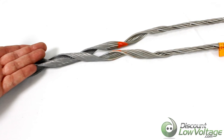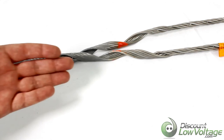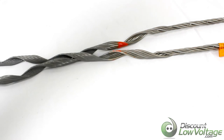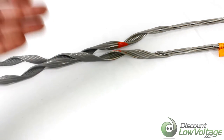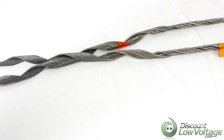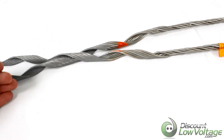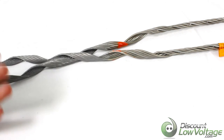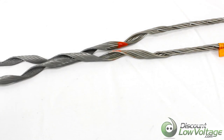The most common question I get asked about the light tension dead ends is what the span length is. If you're going from pole to pole, the 300 feet is the maximum span length. That's pretty decent — you can put a pole 300 feet away and still use one of these, which is a pretty nice run.